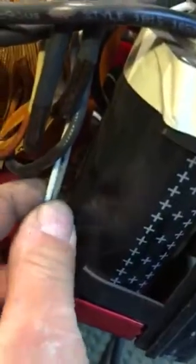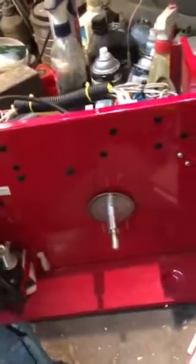If you trace it back down to the bottom you'll see your little drive motor right here. These two wires — basically you're going to cut into them and steal power to the spool gun or back to your normal machine. All I can say is it's doable. It says it's not, but many of us have proved it is. If you're good at doing a little bit of wiring, that's all you've got to do and you can weld some aluminum. Hope this helps!